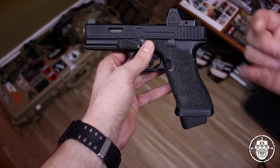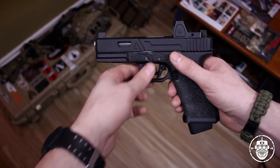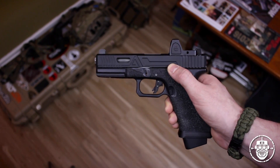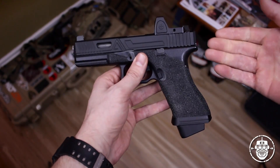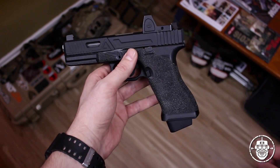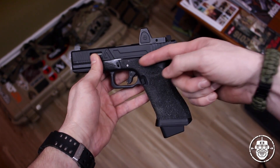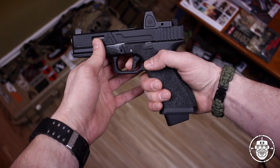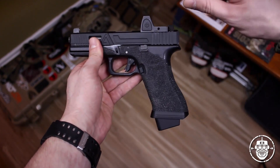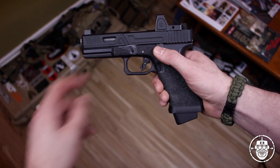As I've said in my previous reviews, I always recommend you go inside and polish all the inside surfaces - rails and metal that come in contact with other pieces of metal. I actually suggest you mirror finish them, making them as smooth as a mirror, and that tightness will clear right up. To adjust the trigger, there's a little screw on the inside accessible when you're holding down the trigger with the slide and frame disassembled - just screw in or screw out that tiny screw to adjust the take-up length.